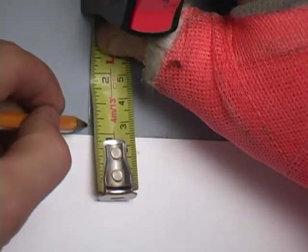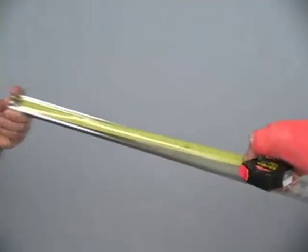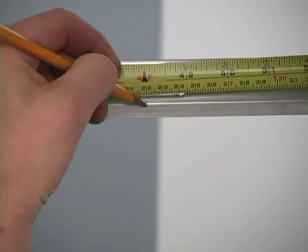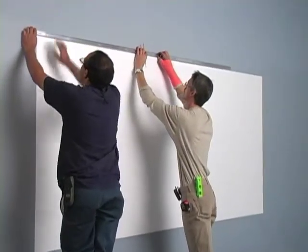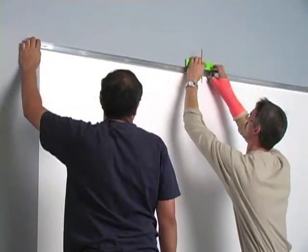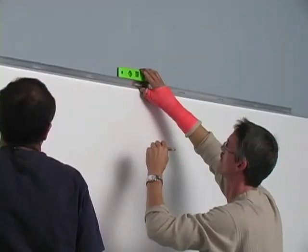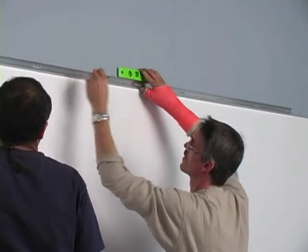Next, a mark 1/8 inch above the Egan wall is made. The track support is then also marked at the 4-foot position. The track support is first located at the 3/4 inch mark at the top left of the Egan wall level and is checked at the 4-foot marking with the bottom edge located at the 1/8 inch mark. The wall is now marked to indicate the fastener locations.